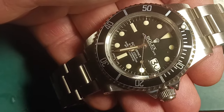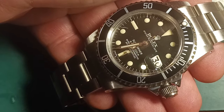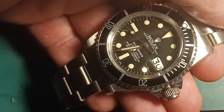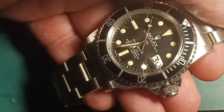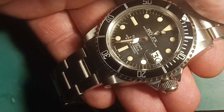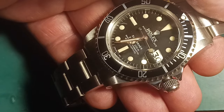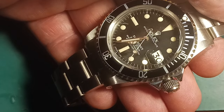Okay guys and gals, thank you for watching — this is the final video for the night. I like the Submariner; it's very, very pretty. Just a couple of bugs to work out: I'm going to have to put a gasket in it, I'm going to have to look into a crystal, and we can't forget the slow date change. That's probably because there's an insert on top causing friction on the dial, so I may have to look into getting a vintage calendar wheel. I'm wondering how that's going to work on a 3135 — it was never made for that. I know the calendar date changes the opposite direction on the older movements, so give me some suggestions out there. Comment below if the slow date change keeps up — is there a date ring made for a 3135?